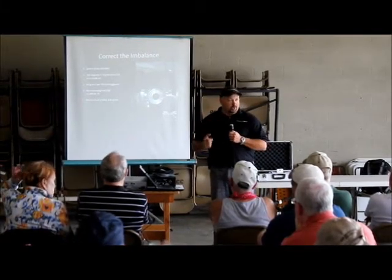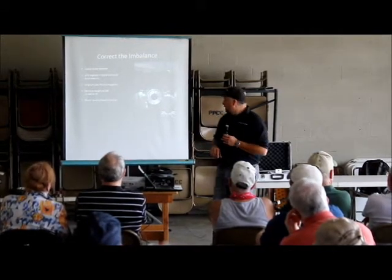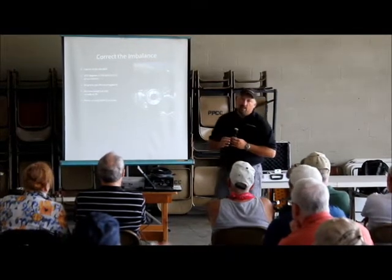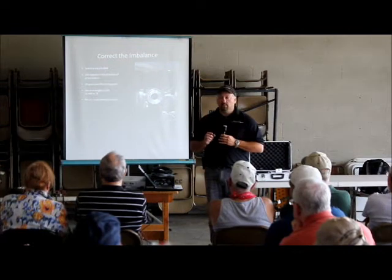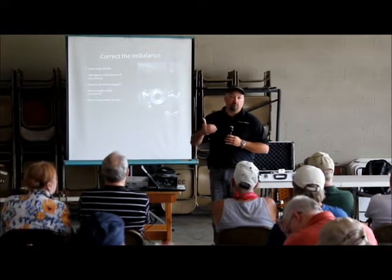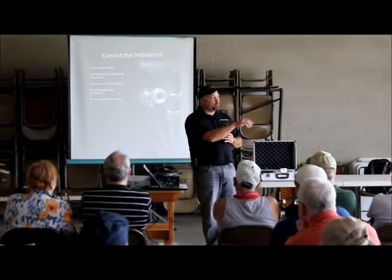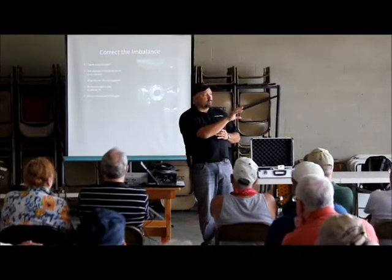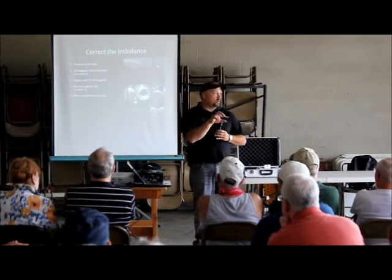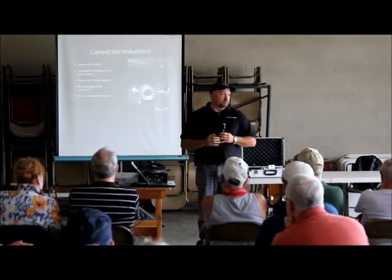A lot of people can't just take weight off, so we usually add weight to the opposite side — 180 degrees out, add weight. We start with 50 grams per ips. So if you have a 0.5 inch per second error, we're going to use 25 grams for our first trial weight. Usually we put it on the outside of the spinner — hopefully you've already got the holes in the back of the spinner backplate. We use trial weights on the outside of the spinner and then move them to the spinner backplate for the permanent installation.